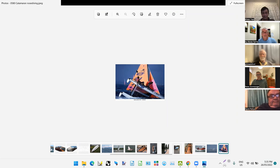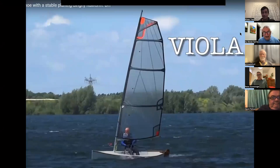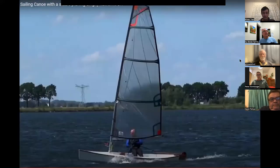Multihulls had trouble with the nose sticking in and tried to fix it by manipulating the bow for many years. This is the Fiola — there's a big gust coming. Normally the boat will heel, but cruising dinghy designers are generally trying to get nice handling characteristics and we try to get the bow to rise gently — not to the crazy extent of the Goose, but something more refined. So the gust hits and the bow pops up — you can see the crew is sitting quite well forward, not having to hike out near the back of the boat. The balance comes up automatically.